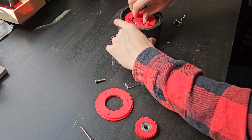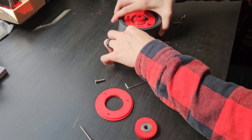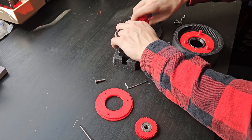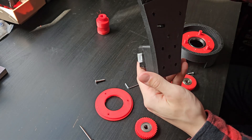The input gear attached to the stepper has 20 teeth, which is attached to the main drive shaft at the bottom which has 52 teeth. That shaft also has an 18-tooth sun gear driving the 36-tooth planet gears to turn the output. This makes the total gear ratio 5.2 to 1.